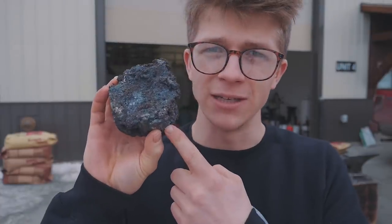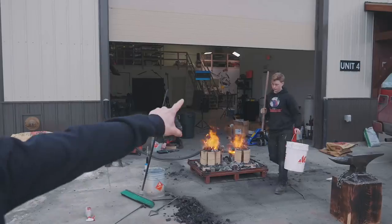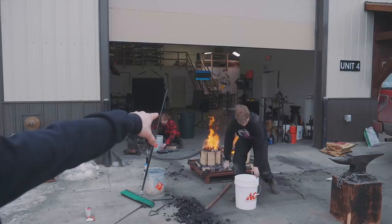And so today, in part one of making our cavalry saber, we're gonna be making a little more steel from Montana wagon tire. Will and Colin are over there making some more in the hearth furnaces. And then we're gonna begin processing down these blooms of steel under the power hammer into bars that are eventually gonna be the blade of our sword.